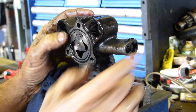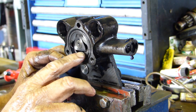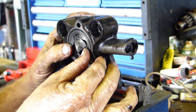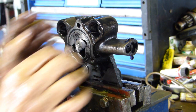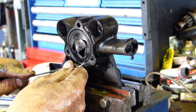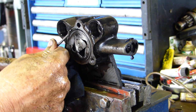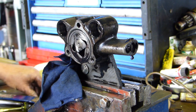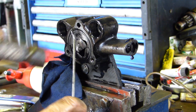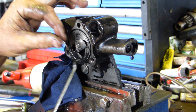What else we look for is there should be a measurement on how much this rotor assembly is below the outer surface. I can actually feel that it's below the outer surface. I'll get the O-ring out. Boy, that O-ring's hard - I'd say the oil pump's been fairly hot. There we go.